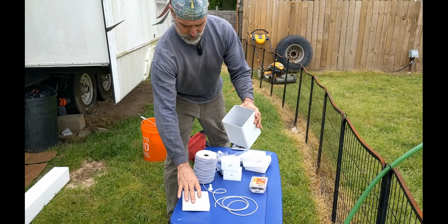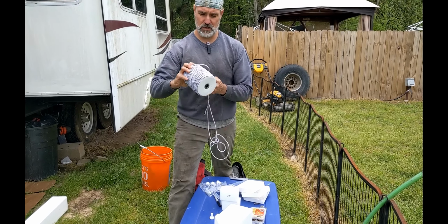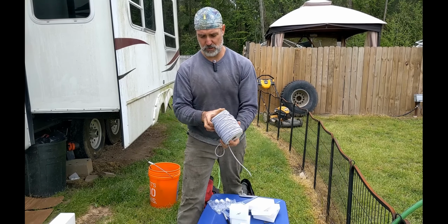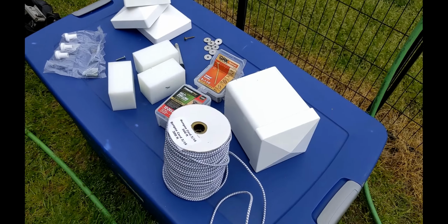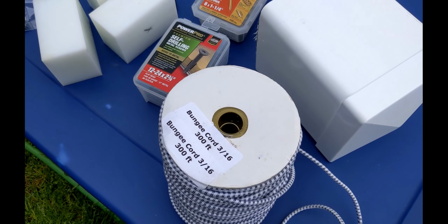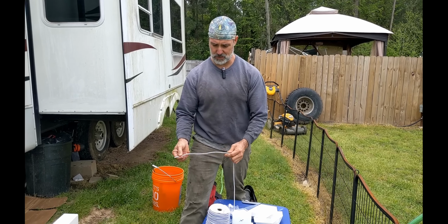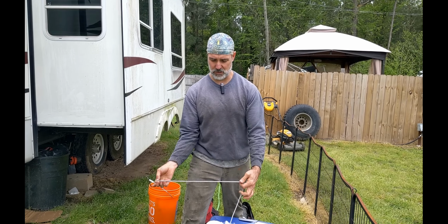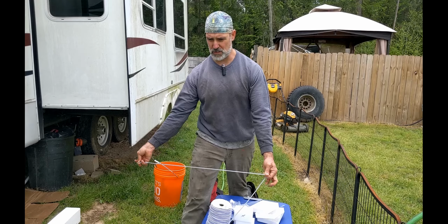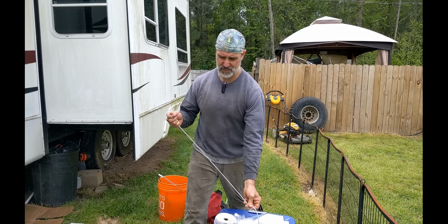The way that we are keeping our lid secure is shock cord. I have other uses for the stuff and scored this big roll for like $50, 300 feet. It's a 3/16 inch bungee cord. Now, there's no reason to do that unless you feel like it. But the easiest thing to do is just go to Walmart or Tractor Supply and get their cheapest, flimsiest bungee cords. You'll have a hook on this end and a hook on that end, and what's in the middle is shock cord. So you'll want probably about 20 inches at least per cord if you just buy those and cut the ends off. 3/16 inch thick is a good size. Quarter inch would probably work fine too.